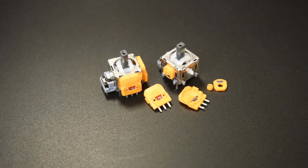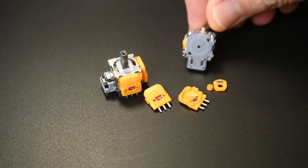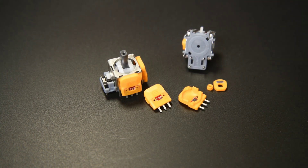I do wonder if Favor Union is making these for some other company. The Hall sensor part will snap in place on a Favor Union joystick — of course the shafts are different, so you can't just replace the Favor Union potentiometers with the Hall sensor and magnet piece, but the mechanical parts are just so similar. So I really think the different feel is coming from the signal output of the Hall sensor. The more I use it, the more I like it, and you can't beat the price. With no potentiometers to wear, it seems like the way to go. The downside, I guess, would be the slightly different feel.